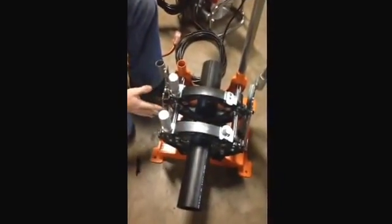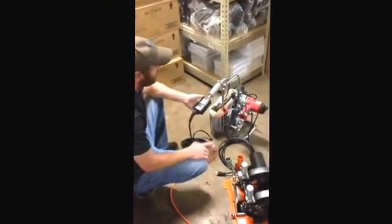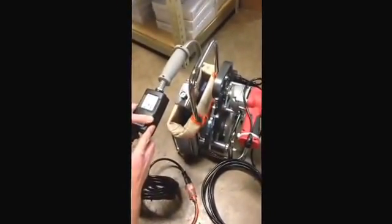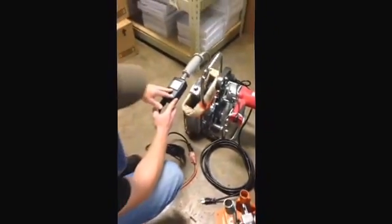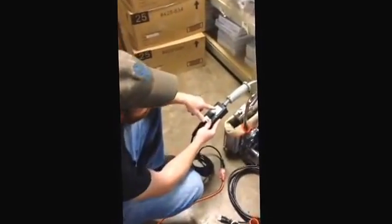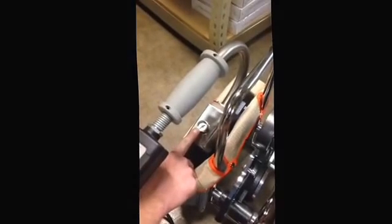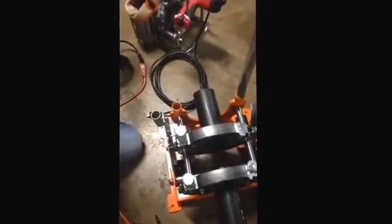Now that we are in alignment, we'll go on to the heating phase. This here is the heating plate, currently set at 424 degrees Fahrenheit. This RITMO machine is equipped with what's called a Digital Dragon — a digital temperature thermostat. It allows you to adjust the temperature in two degree increments and is displaying 424 degrees Fahrenheit on the screen right now. This machine also has an analog temperature gauge in the heating plate itself so you can verify that your temperature is indeed at the correct fusion temperature. This is 3 inch IPS SDR11, and right now I'm going to start the fusion.